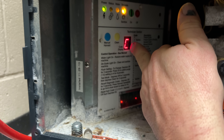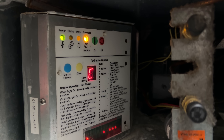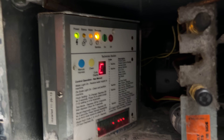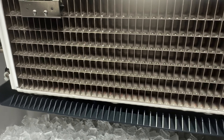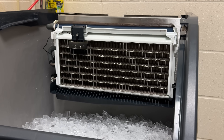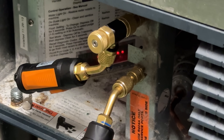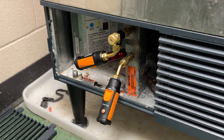Our main things are our sensor and our water sensor. Hit clean, and it should start blinking. Before it was blinking, now it's not blinking. So now it should do a drain cycle over and over, and then it'll also recycle the timer in there so it tells you when it's time to be cleaned. Then we can get started on the refrigeration section. I'm getting a better look at those plates and you can really see what's happening — it's starting to come apart. They basically tin or solder them together of some sort, and that's not looking very good. I'm going to let him know that there's a good chance this needs a new evaporator, but at this point I would probably just recommend a new machine. We have our valve core depressor tool there from Apion, which I got from True Tech Tools — it actually will lock in the refrigerant and you lose almost absolutely nothing when you're using it.